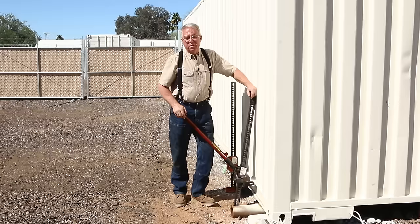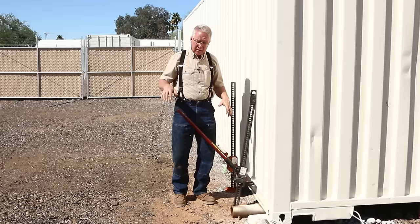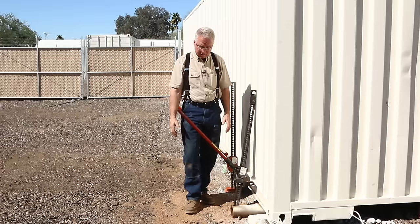One of the characteristics of these jacks is that they're not lifting straight up under the load like a bottle jack. They are on the side of the load. And the further up the bar you get, the more squirrely any load becomes. When I was 20 and running my sawmill, leveling it up with these things, it was really squirrely when you had an 8,000-pound machine three feet up in the air.